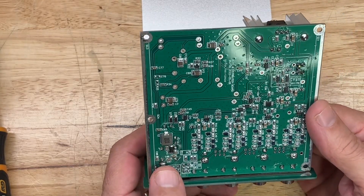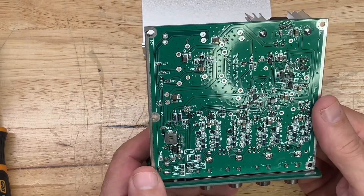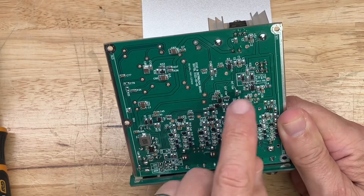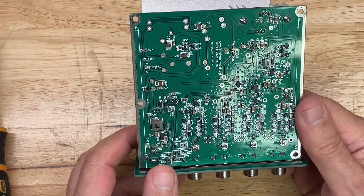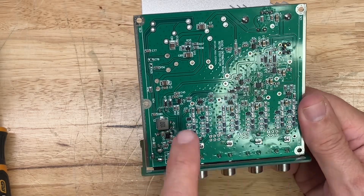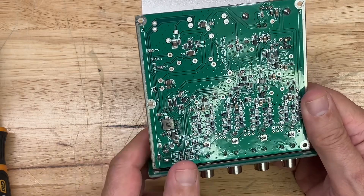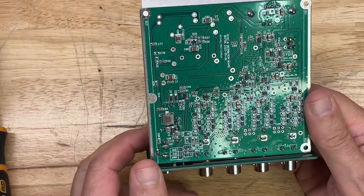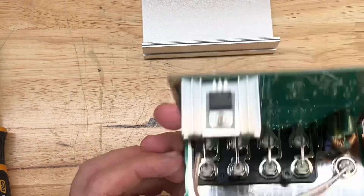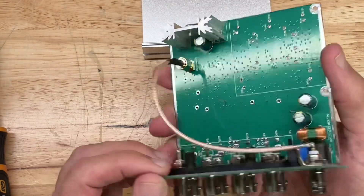On the underneath side there's more surface mount circuitry. I was thinking this must be analog amplifiers, but in fact it's probably digital logic — CMOS or something like that. All these little chips are probably digital buffer chips or inverters. You can see these strings of capacitors and inductors — those are obviously a low-pass filter on the output to allow only the 10 MHz signal to pass through, cleaning up the digital output into a more sinusoidal waveform by eliminating all the harmonics. They lead directly to the BNC connectors. There's also a solid ground plane on the back of the front panel for complete shielding — very nicely constructed.